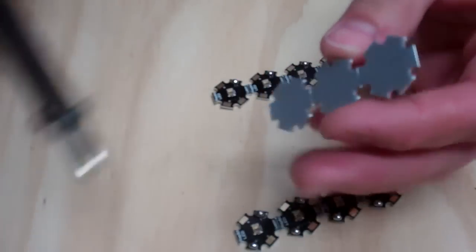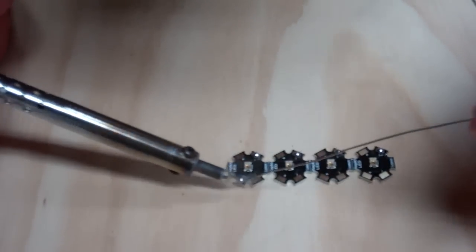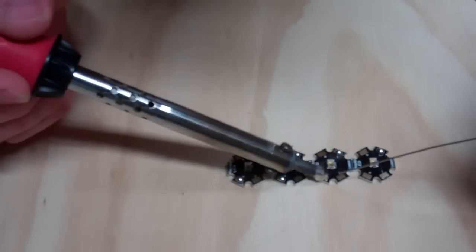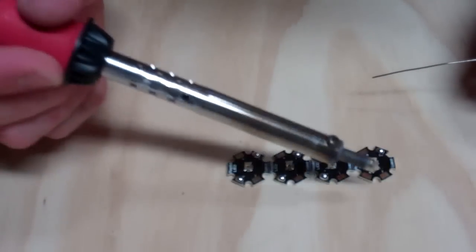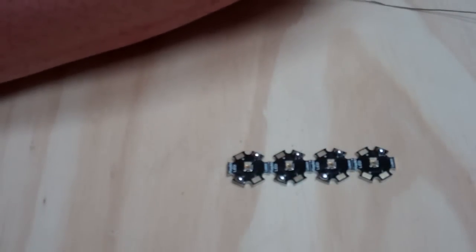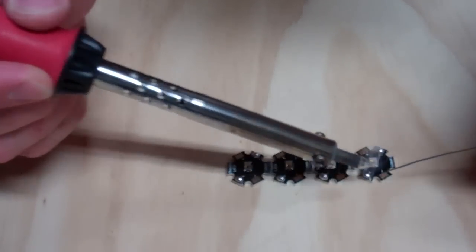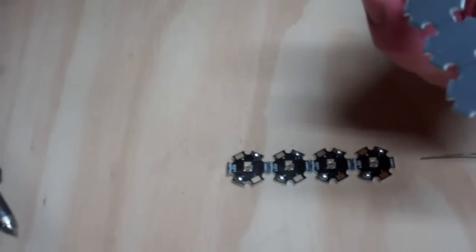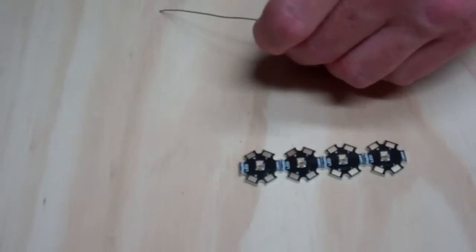What you'll end up with is probably a little bit of rosin splatter on the bottom, because it gets on the board and then when you do the next round of soldering it gets sticky. What I do to get that off is use denatured alcohol on a paper towel — get it on the back of the star and just wipe that rosin right off. I also do that to the heat sinks. I use the Bergquist thermal pads, and you want to really clean those heat sinks well before you do that, because sometimes they come with grease and oil that causes the thermal pads not to stick very well, and then causes the LEDs not to adhere very well.